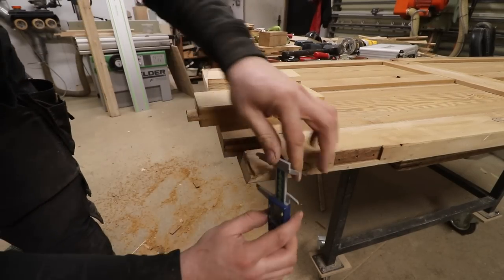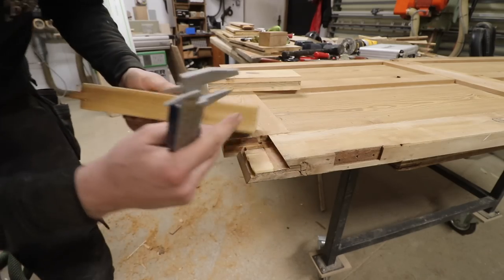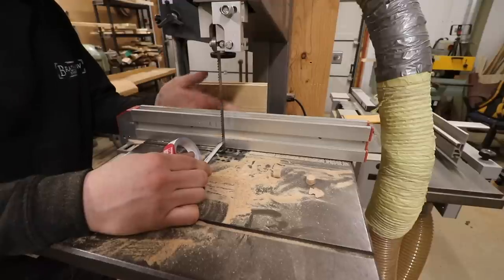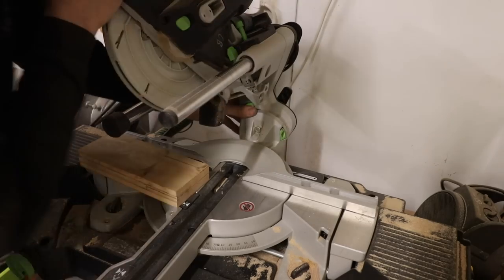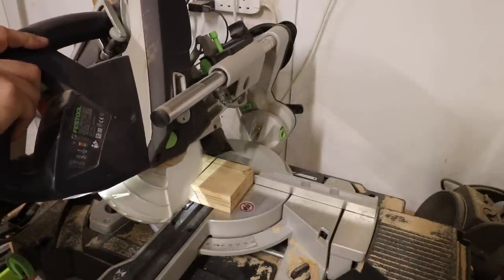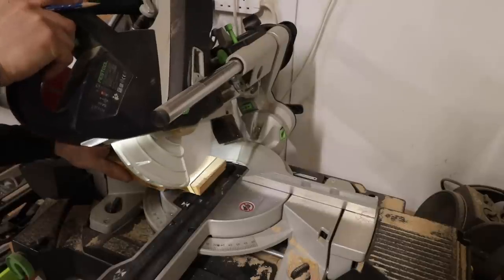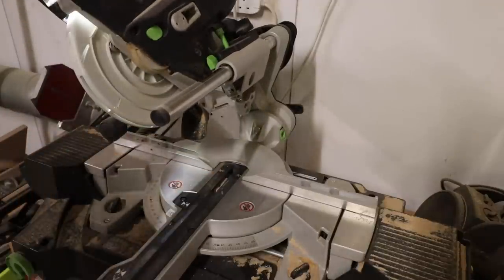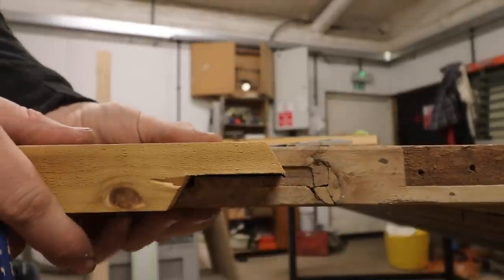I've just squared this piece up. We've got 17mm, so I'm going to take that measurement and house it out of this piece of wood, then cut the two 30-degree angles on — that will slot in and glue in place. I'll keep working that cut until it seats both sides nicely.